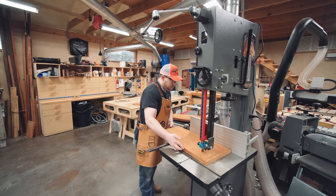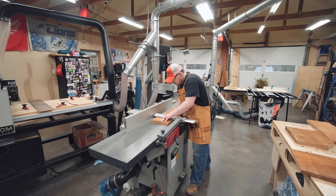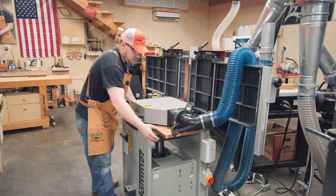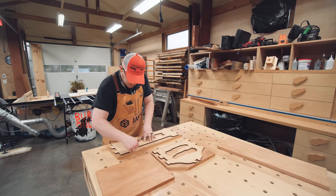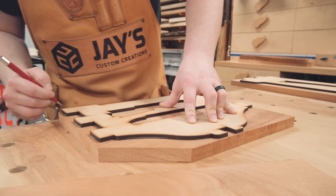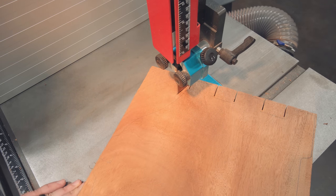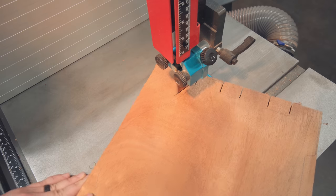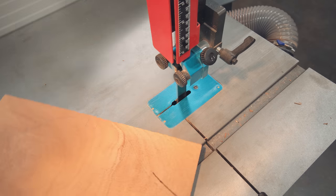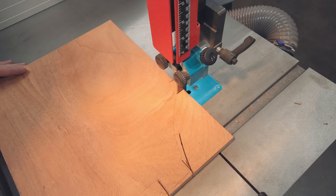The rest of the milling process is pretty typical: first ripping some extra material off at the bandsaw, jointing one wide face at the jointer, and planing the opposite face flat and parallel with the planer. Now the templates can be traced to the mahogany so we know how much extra material needs to be removed before pattern routing. For the waste removal I started at the bandsaw. I've had this bandsaw for about a year and a half and since day one I've had this one-inch carbide-tipped resaw blade installed — it's an absolute beast for resawing wide or thick hardwoods, which makes it a bad choice for cutting curves.